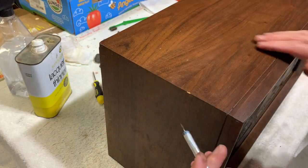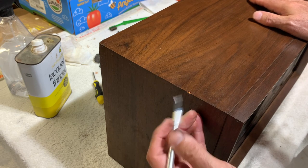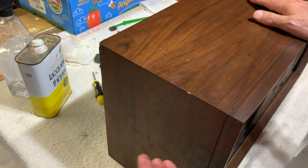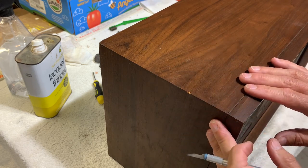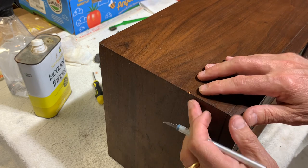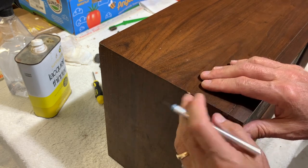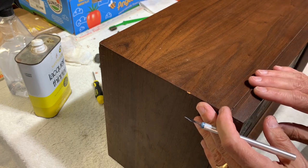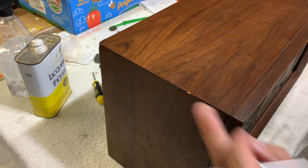I want to pause and show you another repair we need to do. There's a little chip in the veneer right here at the lower corner — it goes up onto the side about an eighth of an inch. A very common ding. If it were bigger, we'd actually use a piece of walnut veneer to patch it, but here we can use polymer repair sticks — heat them with a little soldering gun, fill the chip, shave it down, and blend it. Let me finish cleaning up the boxes — still need to do the top, bottom, and bezel — then we'll do this repair and keep moving.